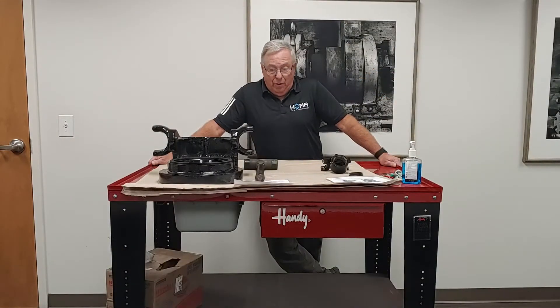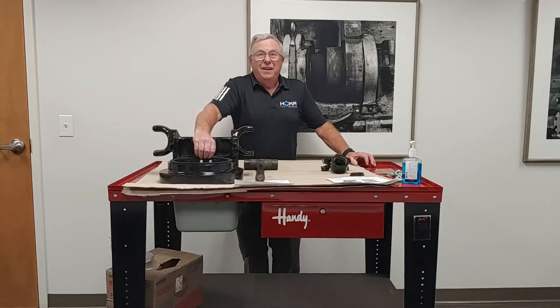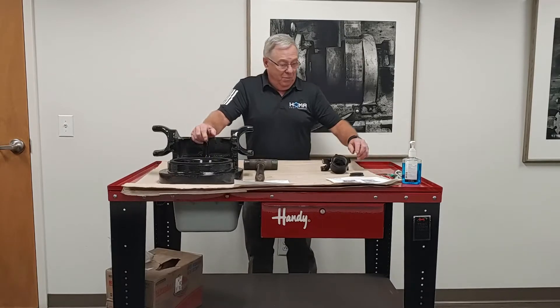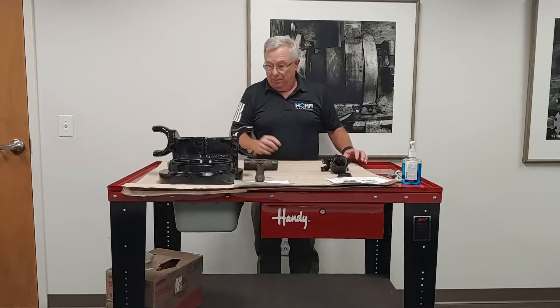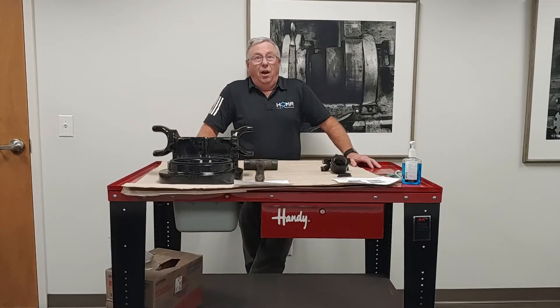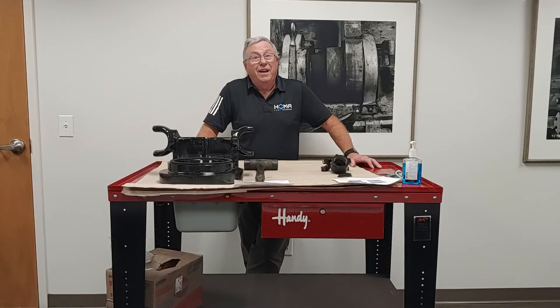In concluding our video today, I just want to emphasize that if either profile gasket goes in too easily, you're probably installing it upside down. Make sure the wider edge is always down on eight inch and above, and the wider lip is always down going into the claw on two inch through six. That's going to end our video for today. Please come back soon to see what other exciting service videos we'll have. Thank you for watching — I hope everybody got something out of this.